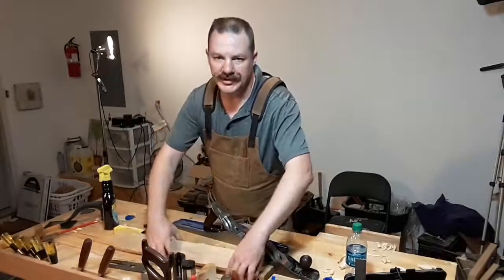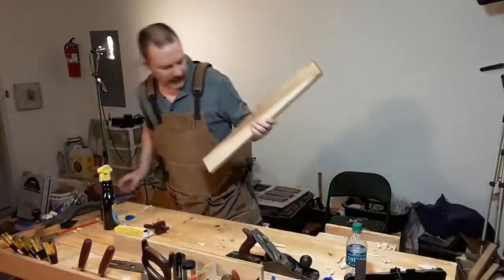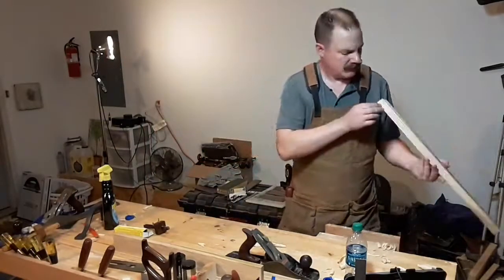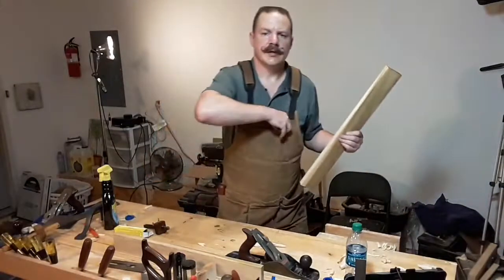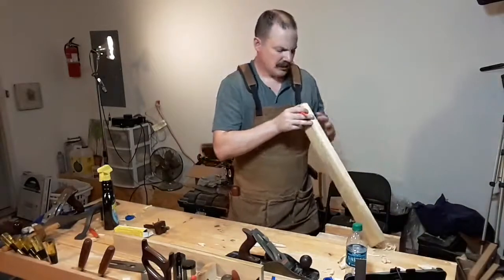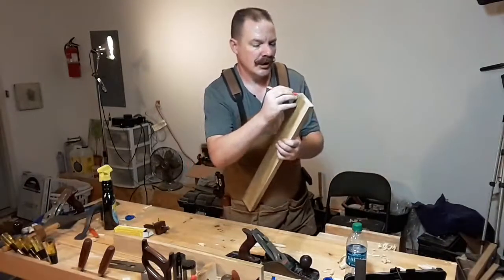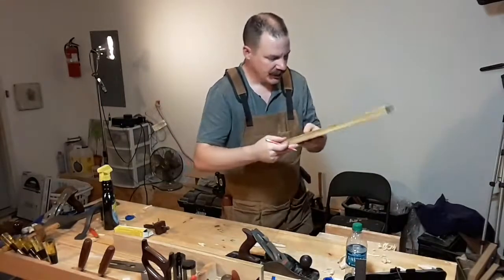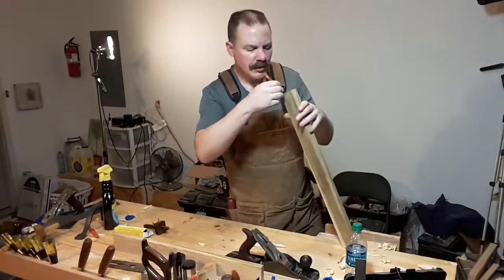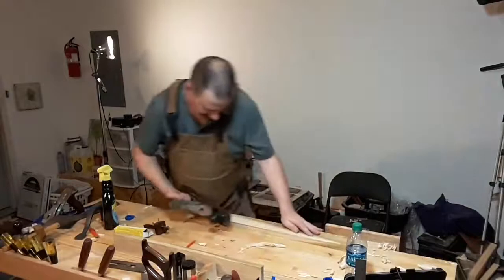I'm calling that one good. Or at least, I think if I try to do any more on it, it's going to just make it worse. Alright, let's put this a little bit less precarious on the edge. Let's get this marked up properly so we know where to stop. Alright, so this piece is 15/16, we're bringing it down to 3/4 proper. And I've still got a rough face over on this side, so that's got milling marks, which we don't like. Chamfer off this edge a little bit.